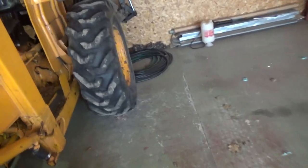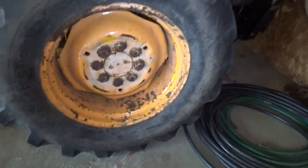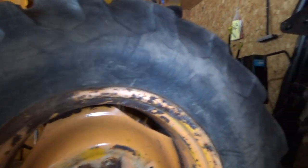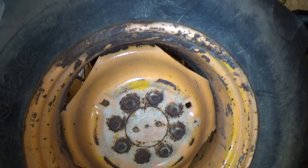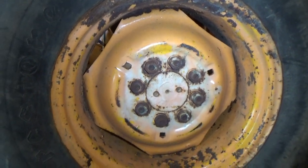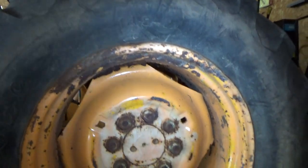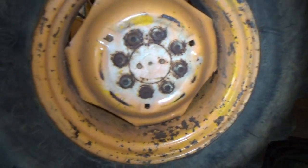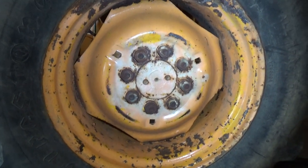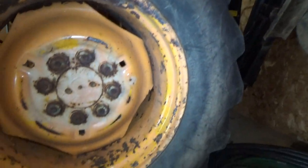The rims. This is an industrial tractor, not a farm tractor. This tractor came with solid welded rims — not moveable rims — but they rusted out pretty rapidly. The centerpiece is a lot thicker and heavier than most farm tractors. I've seen a number of these on the internet where they've replaced the rim with a farm tractor power-adjust or removable rim, but that would not be the original rim. So if you see rims other than the solid welded rim, somebody has already replaced them.